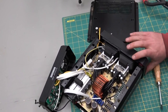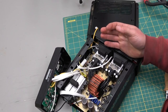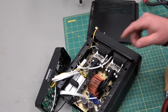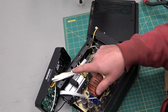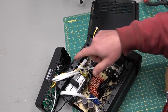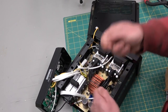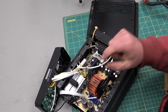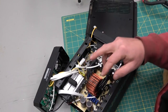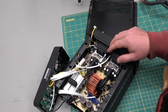Now, what is going on to the best of my ability? How this works — first off, how do they take 12 volts DC and change it into 120 volts? They angry up those pixies and instead of making them run in a straight line, they make them run back and forth 120 times a second. This is not going to be a perfect sinusoid because what they're essentially doing is taking little switches, turning them off and on very, very quickly — that gives you ones and zeros, it gives you a square wave. The quicker they switch them off and on, the closer they can approximate that sinusoidal waveform, and we will see that on the oscilloscope periodically.